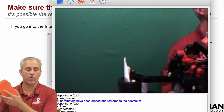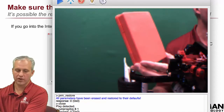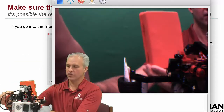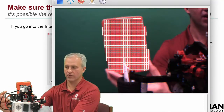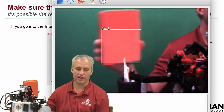Typically you only need to train one color — color signature 1. I'll train it again now using the button on top. Hold the button until it goes red, then let off. Now it's learning the color — press the button again and it flashes to confirm it's now tracking that color.